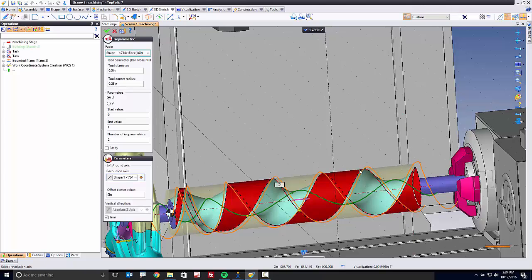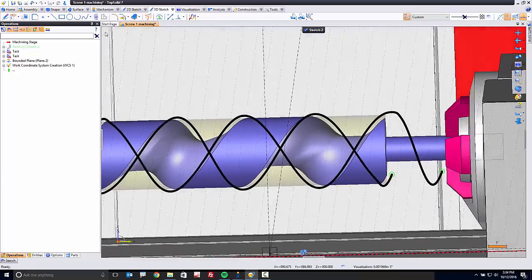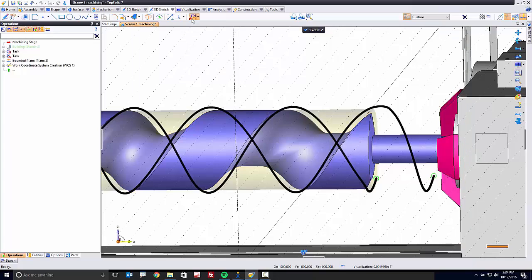And what these curves are calculating are a shift for us to start the tool path further in on both sides of the tooth. Now, because TopSolid is trying to make things easy for you, we extend these curves way past what you need. So we need to trim those back a little bit. How do you do that? Simple. Let's go to trimming.